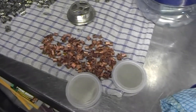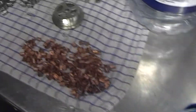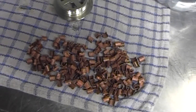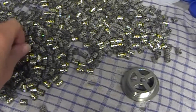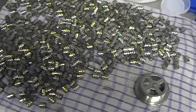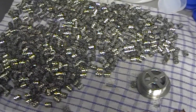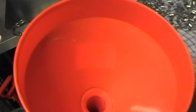Packing the column is a bit of a tedious job. Drop the copper in first, keep tapping it and settle it in, then carry on with the stainless rings. You should get everything back in that you took out. Have a little tap now and again to help settle them in - you don't want to overdo it, but if you're left with one or two it's not going to be the end of the world. Another tip: get yourself a big old workshop funnel and just trickle them in - makes life a lot easier.